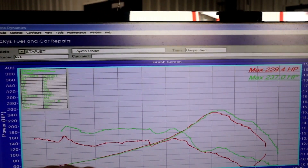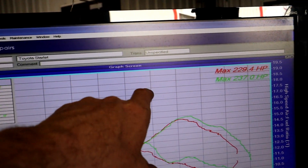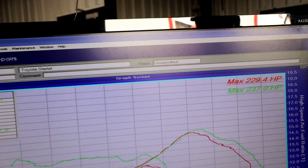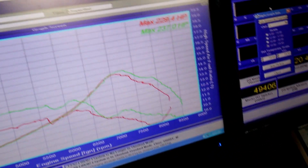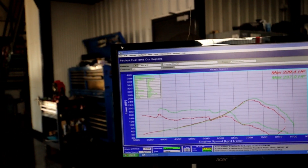Hey boys, welcome back again. So we went and ran Nick's car on the dyno on Saturday with the new G30 turbo on there, and sadly we couldn't even pull over 250 horsepower. The car's got stock cams and it does have aftermarket valve springs. We came to the conclusion that it is running out of intake manifold flow. The engine starts coming up hard on boost and around 7,000 hits peak horsepower of 240, and then from 7,000 to 8,500 we're losing around 140 horsepower and the car ends up at sort of 100 horsepower at the wheels.